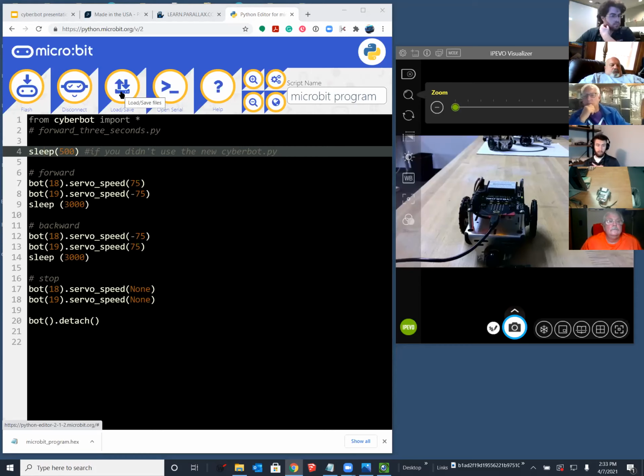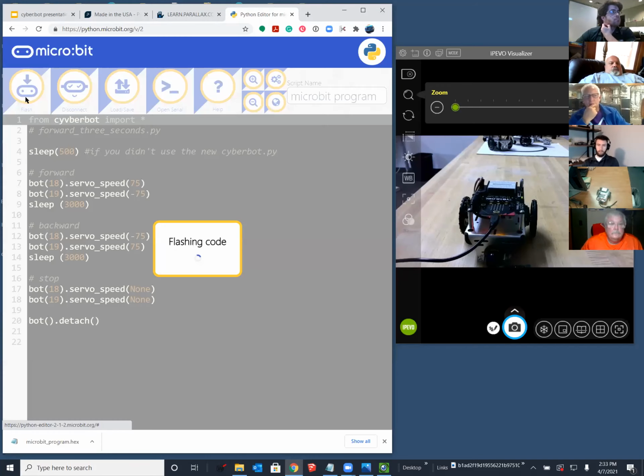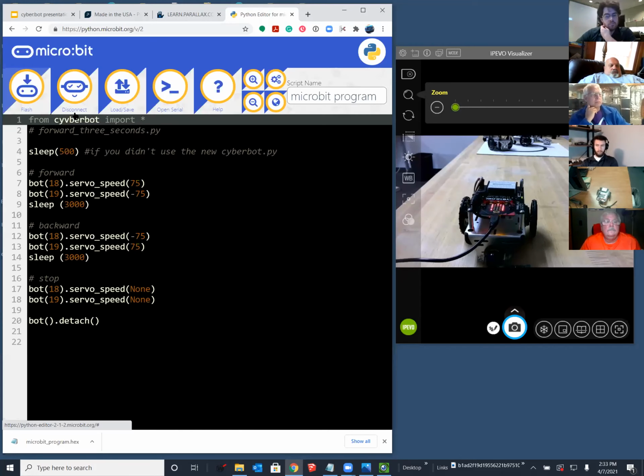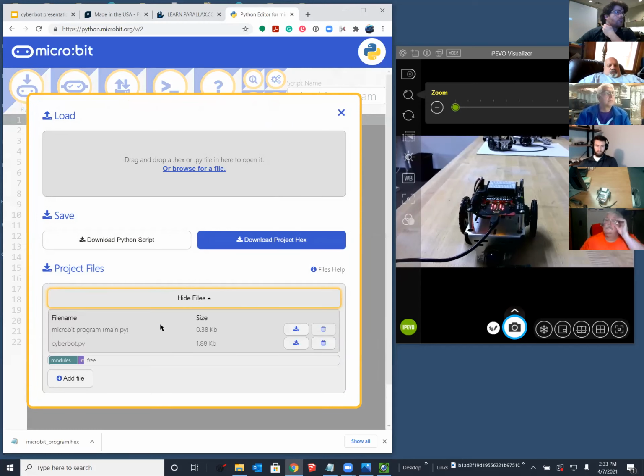Okay, so if you have a problem, let's just say that we have a syntax error, and I'll create one right now for us. I changed the name of the Cyberbot module, but what you have is, it's not actually there. That didn't do what I wanted, but let's look at how to add it again. If you go into load save and then show files, at the bottom, you'll see that cyberbot.py is probably not there.